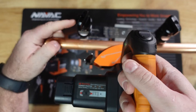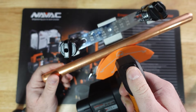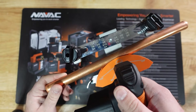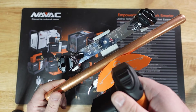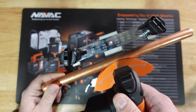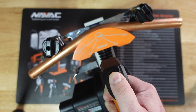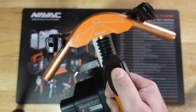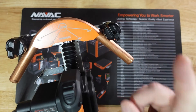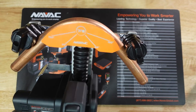Double-check that we are in seven-eighths on both knob assemblies, and by sliding your thumb forward on the switch it will begin the bending process. If you release your thumb there will be a positive stop on the tool — this is one of the huge advantages to the mechanism we've developed. It truly gives the technician ultimate accuracy and control of the angle they wish to bend. For this demonstration we're going to go full 90 degrees, which is the max bend on this tool. We have hit our 90-degree angle — you saw how smooth and quickly that was performed.